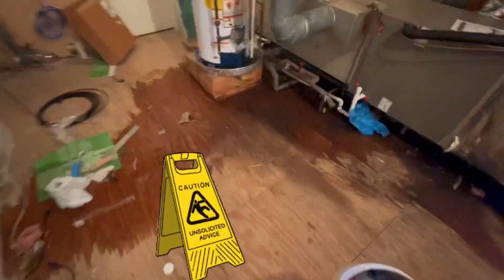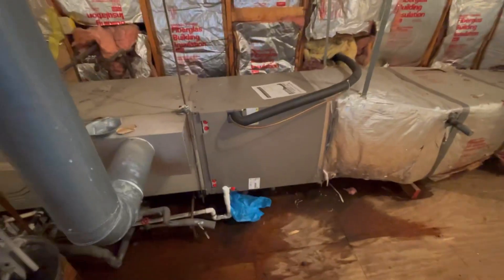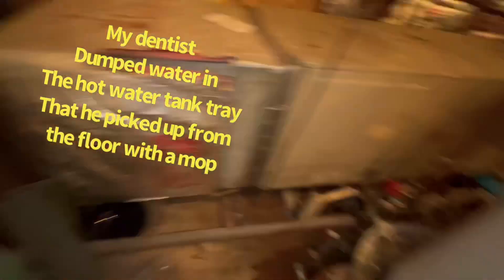Imagine getting an air handler up in here. I'm inside the evaporator coil section looking around. There's your evaporator coil. Let's see, we got our drain. It's not — I see water in the hot water tank section. I got water right below there. Let me take a look down in here — yep, we are overflowed, everybody.